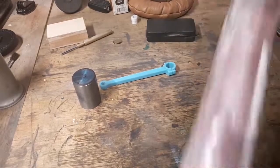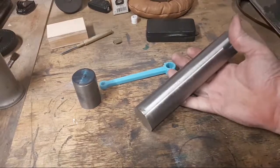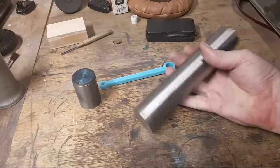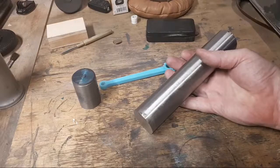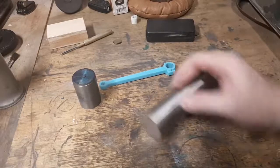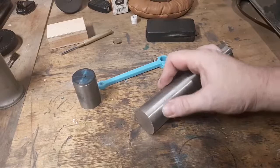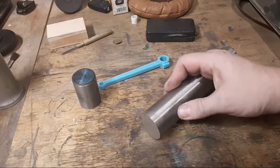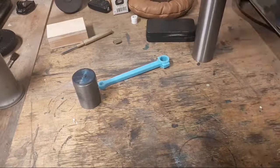I don't feel particularly like chopping the end off that with the hacksaw, so we'll try parting it, and if we don't have any luck with our new cross slide, we're probably going to do okay with that. But it's pretty solid, and it's 4140, so if we can part this much off, we'll make a camshaft out of that with the camshaft gear on it. That's another job.